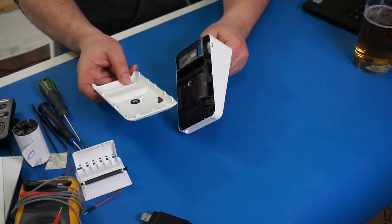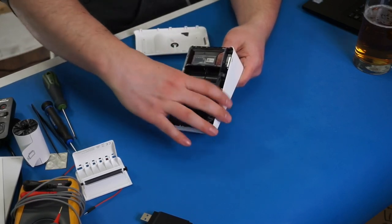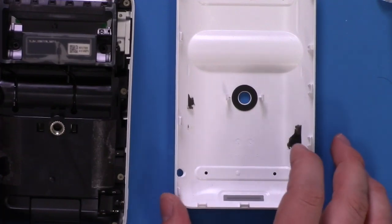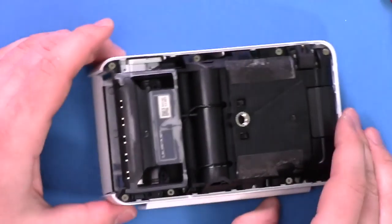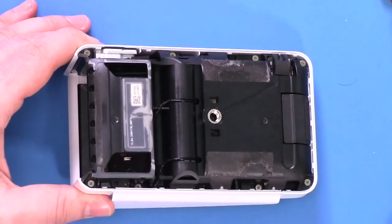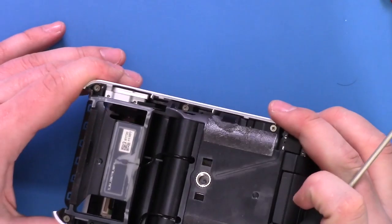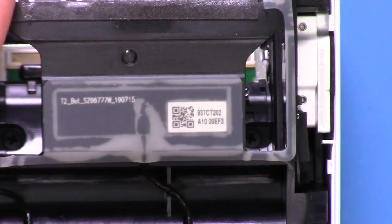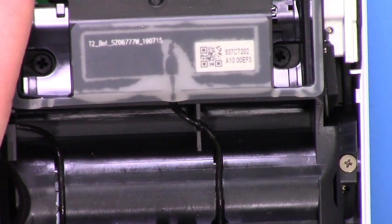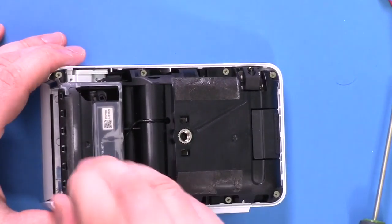You can see the whole thing. There's a bit of double-sided tape here. On the back of the enclosure there's not a whole lot - just plastic. We're curious if there's any tamper stuff. You can see where the paper would be. There's something here - originally I'm going to assume an antenna. There's a QR code, which could just be part of manufacturing. There's a T2 label and then this QR code. It looks like some sort of cable going there, so that could be an RF cable. Around the side there are a bunch of screws.